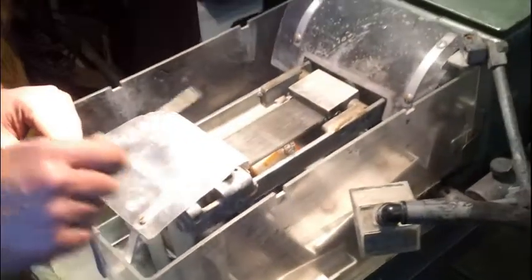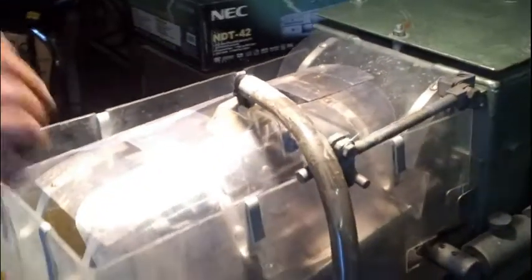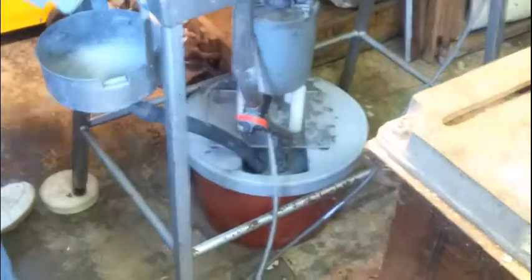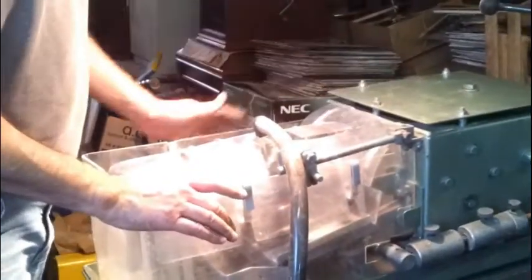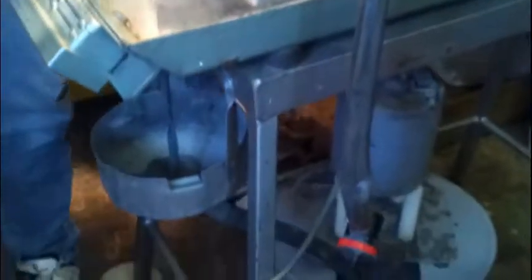It's all been put in place now. It's taken a few more minutes than I expected but now we are ready for the cut. What's important at this particular point in time is that we start the machine — start the pumping unit first. The grit will come from the pumping unit and start to run over the blades. We'll then turn the machine on itself and start to cut. We can see that the grit is now flowing over the blades, running via the return line back into the bucket. The next thing for us to do is to turn the machine on.